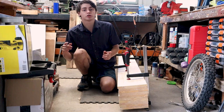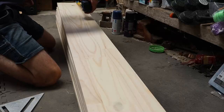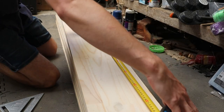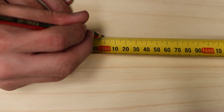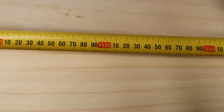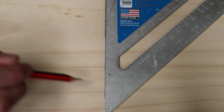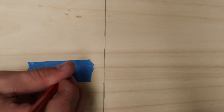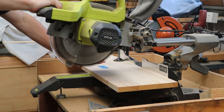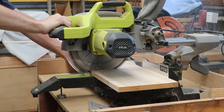What we should do at the start of every project is mark out and label these pieces. I'm starting off with building the longest shelf that's 1500mm long, so we can measure and cut that down. I always recommend using a speed square and drawing across the whole board. I strongly suggest labelling all the pieces with some tape after you mark them so you don't lose track. I've decided to use the chop saw to cut mine to size, but all the other options I mentioned before will work.